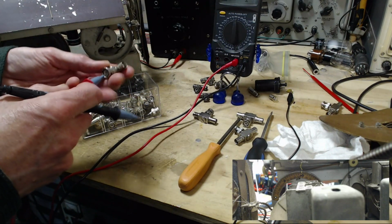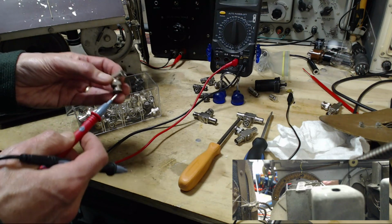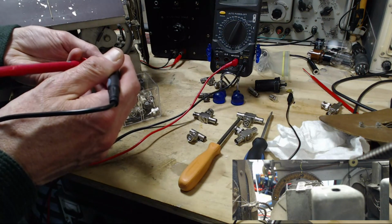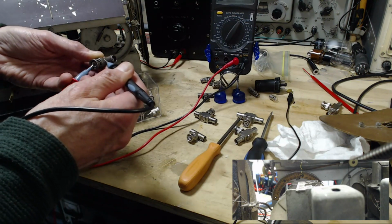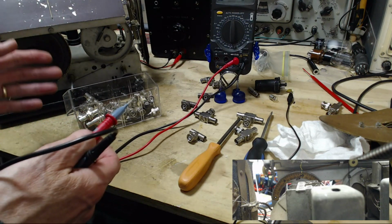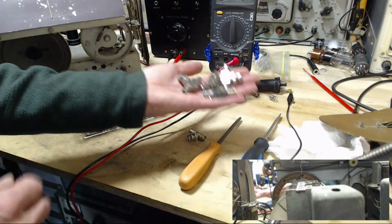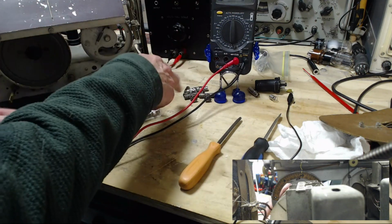Now this one also showed the same thing. 55,000 exactly. But these ones showed nothing. Huh. Just a really much bigger one. I would never have imagined there was a resistor inside there. 55,000. So we're on the AVC circuit, and obviously 55,000 ohms is enough to kill it, to knock it down. Wow, no idea. Big lesson learned here today. Don't use these. And test them. Test the ones you use. I've got to bring some out into circulation that I know I can use.